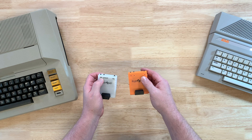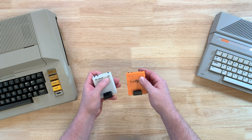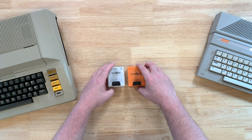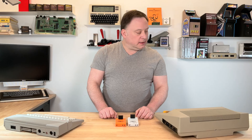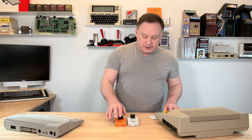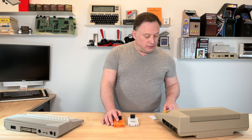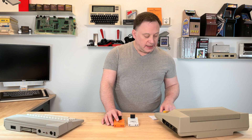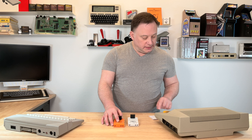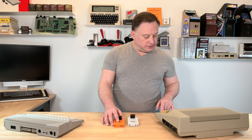I do have labels — I printed these and put them on myself: Wi-Fi, Bluetooth, and SIO, just to complete that out. Now let me take a look at the list of changes in the version 1.6 of the hardware. There's an SIO 5-volt voltage divider for better accuracy, and the motor control signal is now run through a buffer with a pull-up and pull-down resistor change.